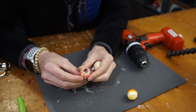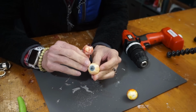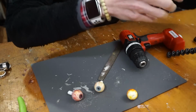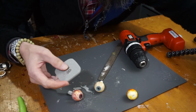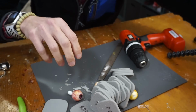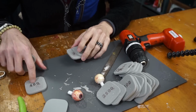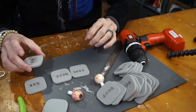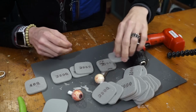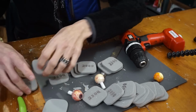So the final step is to polish this, right? So this one's pretty shiny and this one's not so shiny. So what I'm going to do is I have these guys right here, the sponges, which I got on Amazon with the link below. These are not that expensive, and they come with all kinds of grits, like 400, see there's 2500, 3000, 3500, right? 3000 and so on. So it goes to the whole range.